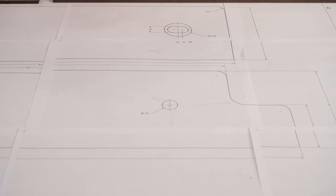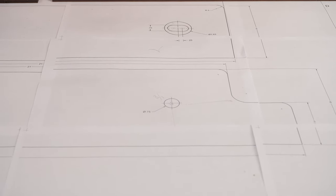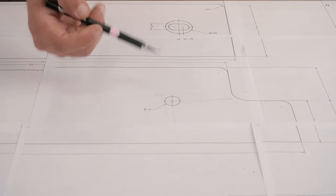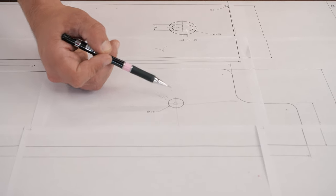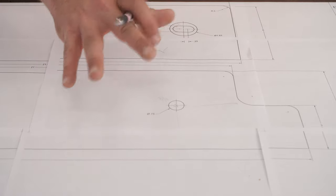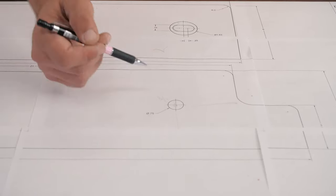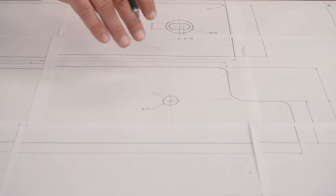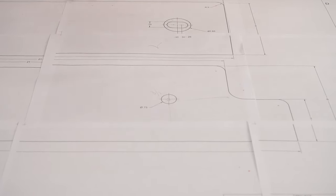Here is the step that makes or breaks our project. We've got our stuff rough milled up, and now we need to worry about alignment — alignment is super critical. We're going to start by double-sticking our pieces together and using one of the templates, or you can find this with a ruler if you didn't buy the templates. Only the holes matter; dimensions don't. They're three inches in and three inches up. We're going to drill an eighth-inch hole through both pieces of wood, and that's what we're going to use for drilling all our other holes and all of our alignment.